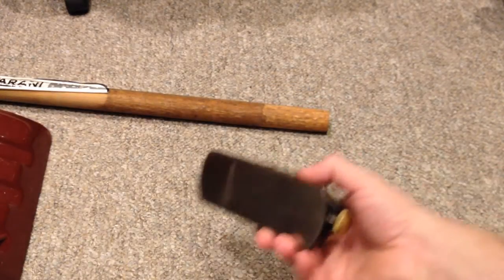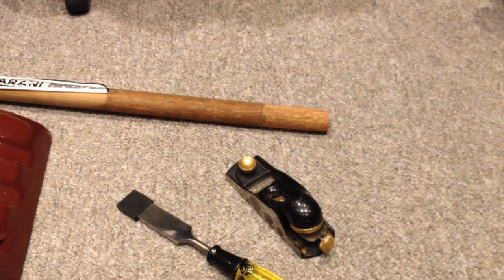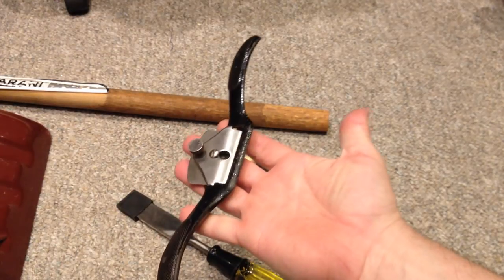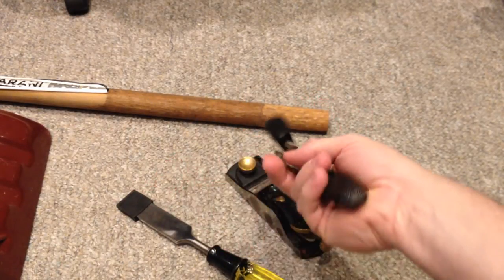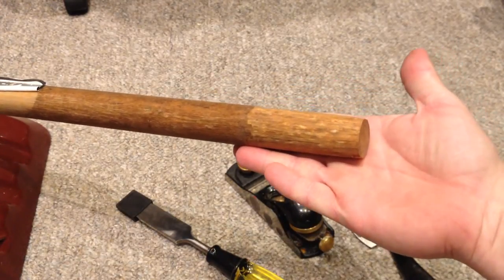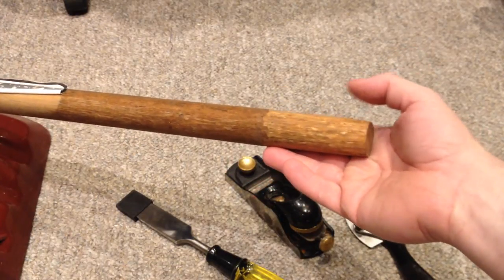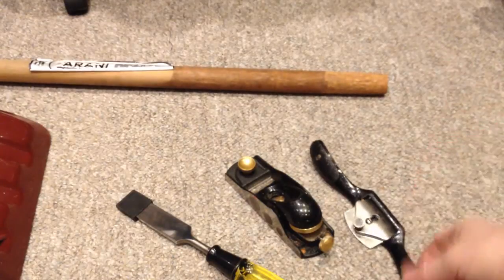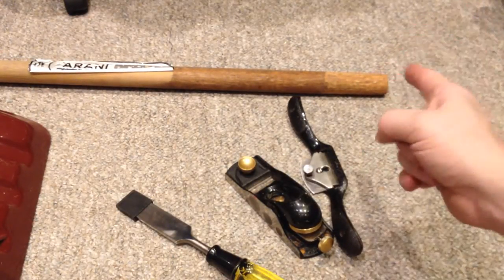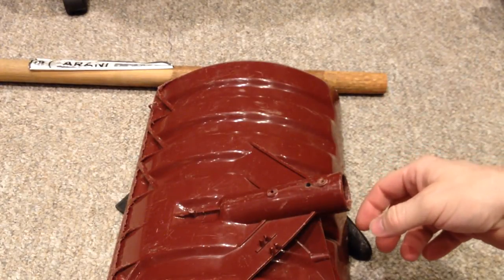For shaping the taper you have three classic hand tools: block plane, chisel, and spokeshave. The spokeshave was used by cartwrights to make wooden wheels and is especially well-suited for making the tapered ends of hand tools like shovels and spades.